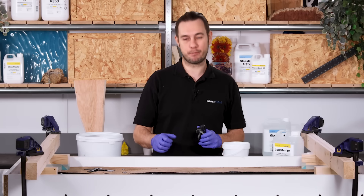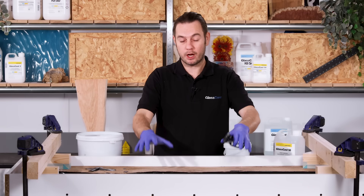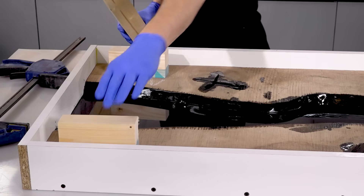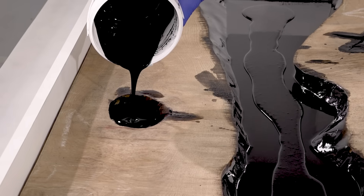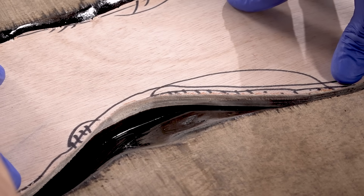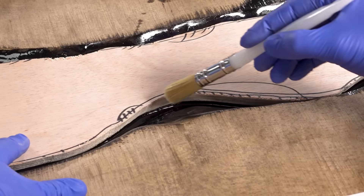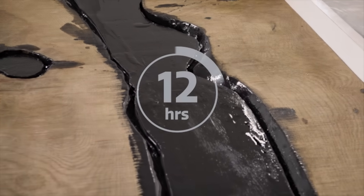Our first layer is at the B stage — that's the point where the resin is firm but still slightly tacky. We can now move on and bond the plywood core into the river shape, mixing up a small batch of our pre-pigmented resin. Pour the majority of this resin into the river and knots, then place the plywood core into the river — tilting one side down then lowering — to help prevent any air cavities. Firmly press the core down along the whole length. To finish this stage we'll seal the plywood by painting the sides and top with the rest of the resin. Leave it to cure for about 12 hours.